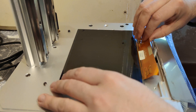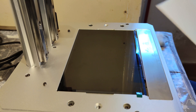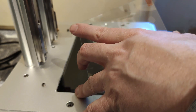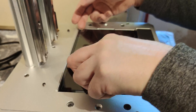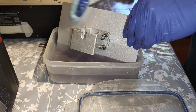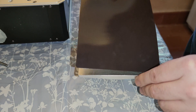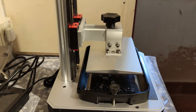Once this arrived, I got about installing the replacement LCD panel along with the new screen protector. I didn't want to damage the old display as it may be possible to repair later and I could keep it as a backup. So I carefully removed the black tape and the panel before cleaning up the edges with IPA and placing the new LCD panel in place. Soon after, the magnetic build plate arrived. I started off by removing the aluminium bed, cleaning up with lots of IPA and even gave the bed a fresh light sanding to remove any grooves that might be too deep for the sticky-back magnet to adhere to. Once it was all installed, it all looked good and the flex still stuck to the magnet.